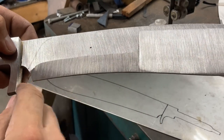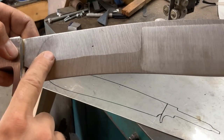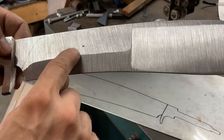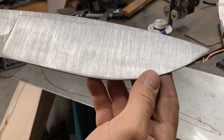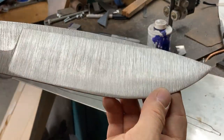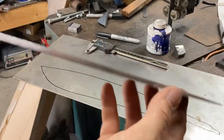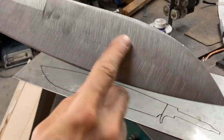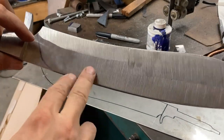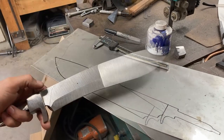And then we will blend the two together, and then we will address the plunges. For now I'm just going to finish walking this up to the spine, rough this section in, and get rid of this little scale pocket. The steel is looking nice and clean — I'm seeing the pattern just kind of peeking out at me a little bit as I go, that's always kind of fun. So I'm going to catch this side up, then get them both up to the spine, then do both sides of the recurve section, and then go to the plunges.